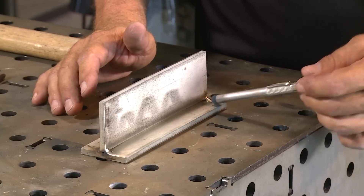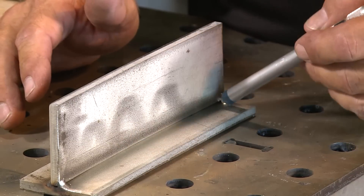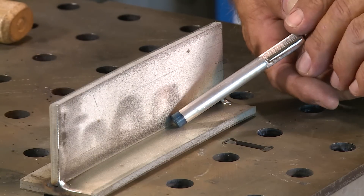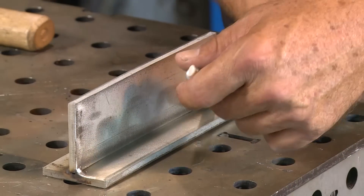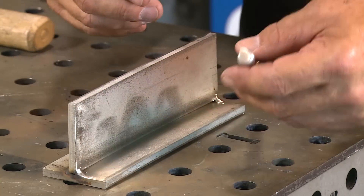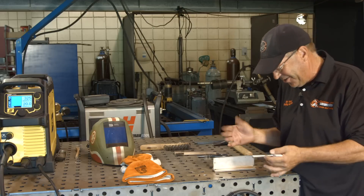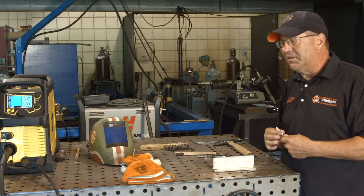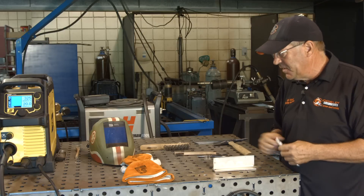I want to get my gear on. I'm going to point my wire pretty much straight into this joint — I may lean it forward just a little bit — and I want to be welding away from me. A big push angle trying to get it to lay flatter would give me more spatter. If I dragged it leaning back toward me, I think it would round up way too much. So I'm going straight into this. It sounds a little raspy — stainless is just sluggish and sounds different than carbon steel where it's nice and crispy.